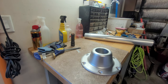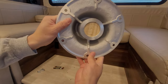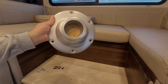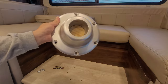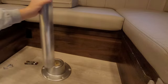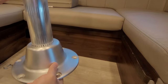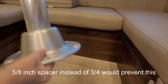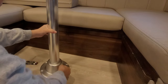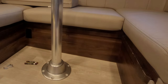Let's go ahead and put this back together. I've got the piece back here — you can see I put the shim piece down inside. That shim was a pain to make, so if someone can make it better with a 3D printed piece it'd be much easier. We'll do a dry fit first. On the dry fit, the issue is that it can spin because the piece isn't all the way down. I'll make that up with a piece of tape to provide a little more friction so it doesn't spin too easy, but at least you can get the table out.